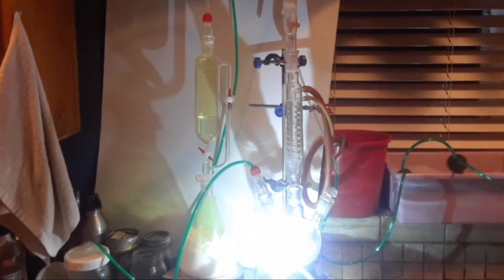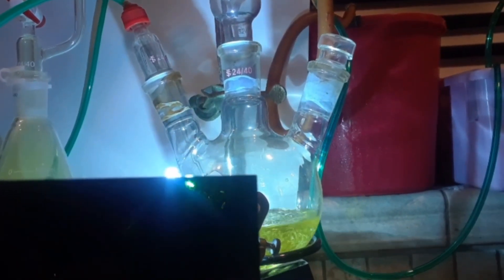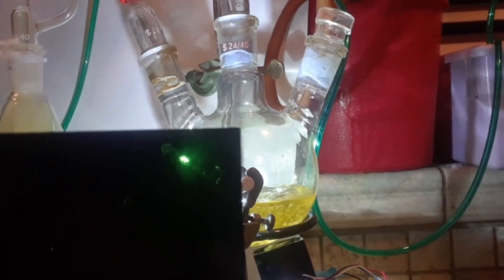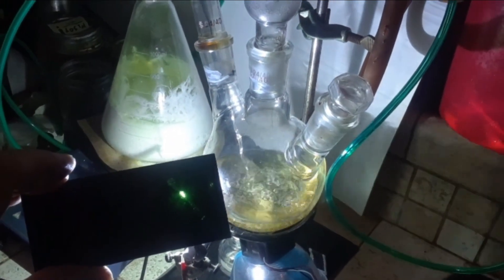The irradiation and reflux are continued until the chlorine generator is more or less exhausted. Interestingly, with the chlorine line disconnected and open to the atmosphere, the hydrochloric acid trap continues pulling hydrogen chloride out of the carbon tetrachloride and creating a negative pressure, drawing air in through the capillary. The raw product has taken on a straw yellow color with a strange, sweet, musty smell. There's a point when the chlorine generator is about two-thirds expended where the product lightens in color from deep yellow to light straw color, after which it goes back to a deep yellow. Having done this reaction three times, I suspect it's at this point, where the liquid lightens noticeably in color, that the reaction is pretty much done, after which the carbon tetrachloride is just absorbing chlorine. Any further attempt at chlorination is probably pointless, though I'd have to distill aliquots and take density measurements to confirm this.